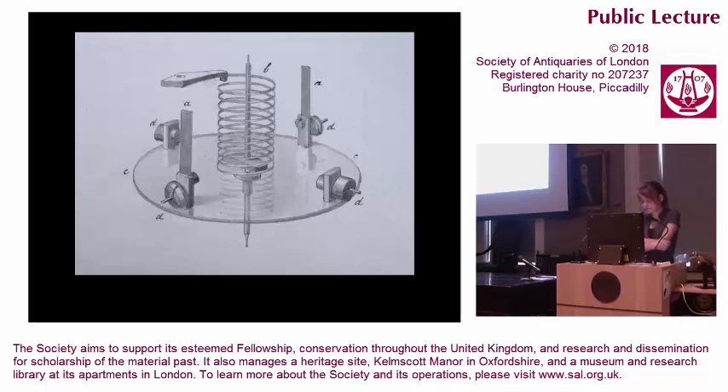Arnold and Dent were prompted to pursue glass research by concern over the imperfect state of balance springs. The material of the balance spring affected going rate: use hardened steel and the chronometer would gain rate; use a soft material like gold or soft steel and it would lose. The problem was reduced by using hardened, tempered steel over a couple of years' use, so the tension in the structure worked out. However, steel came with other issues — highly susceptible to magnetism and rust. Furthermore, and this is the really important one, Arnold and Dent noted that even the best chronometers when exposed to extremes in temperature would lose at the maximum and minimum. The 1833 announcement was not only the public debut of Dent's glass springs, but also the first statement of middle temperature error to appear in print. The firm substitution of glass began as an attempt to do away with this material flaw, and it is compensation for middle temperature error that ultimately explains what happened to the springs.